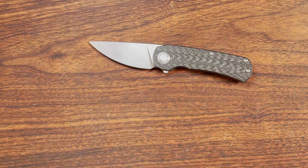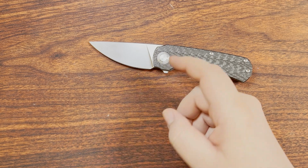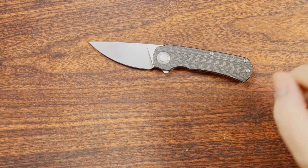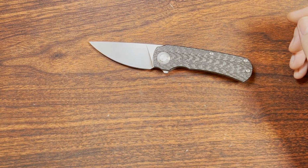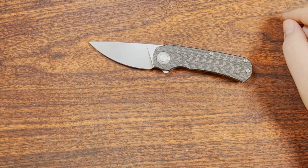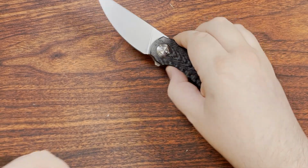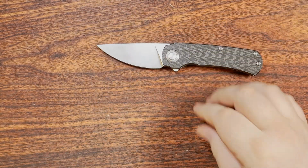This was one of the few that ran into some issues trying to sharpen with the KME. This was one of the last ones before I was like, you know what, and just ended up using the Work Sharp for most things. But even so, I can scratch up a blade like that on the Work Sharp randomly. I don't necessarily know what makes it different or not, but that's why I just throw some painter's tape over the angles on both sides before I sharpen anything.